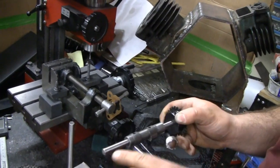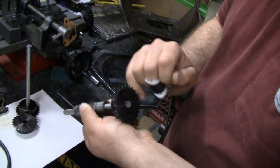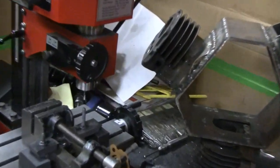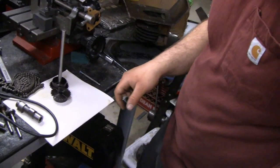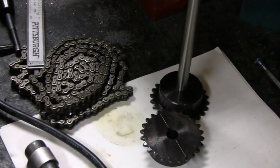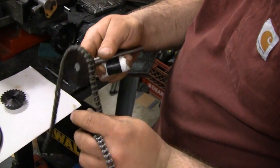If you could buy one you'd probably get it fully keyed, and we don't want that. We'd have to key the cam, and then we'd need a set screw, and there's not a lot of meat for that. Still got the three thirty-second, a little bit in there. Got one more keyway to cut and one more shaft. And there's our little chain — number twenty-five, pretty tiny, but that'll do the job. It's just turning the cam shafts there.